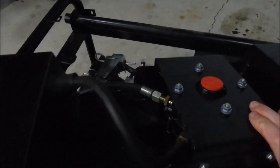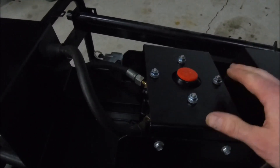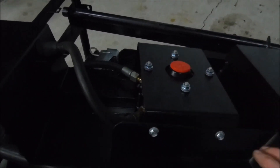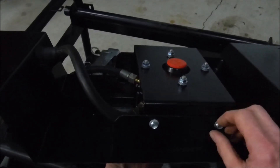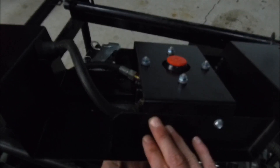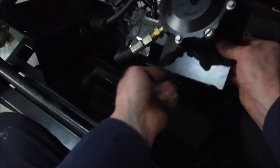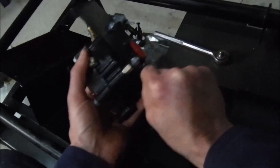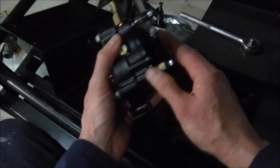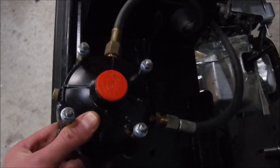Flip it over, and this is the decompression valve under this little plate here. The decompression valve is held onto this plate by four bolts, and this plate is held to the top plate by four bolts as well. With it unbolted, you just pull it out. I need to take these four nuts off and then it'll come off that plate. Now that I have access to the decompression valve, it's time to remove the hoses.